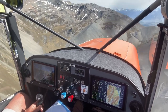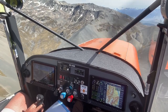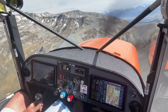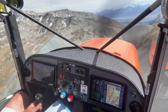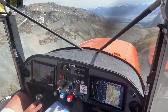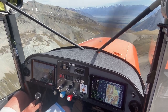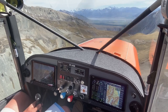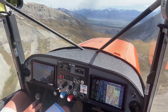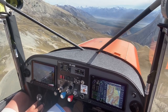I've done quite a few flights now where I've loaded the aircraft up to an aft CG and much higher weight, and I've played around with takeoffs and landings and stalls at those weights and at the CGs, and I've compared that to the forward CGs. We've made changes to the rigging on various occasions. We've removed some of the reflex out of the ailerons and compared handling. We've changed the rigging a small amount on each flap and compared that, and overall I'm getting a very good feel for the aircraft now, and it's flying much, much better.